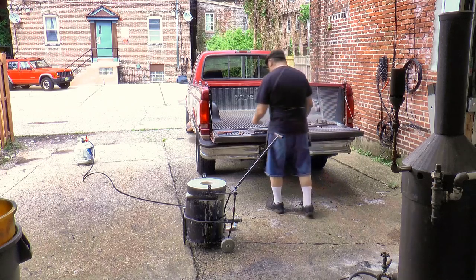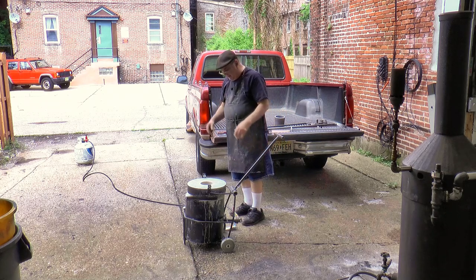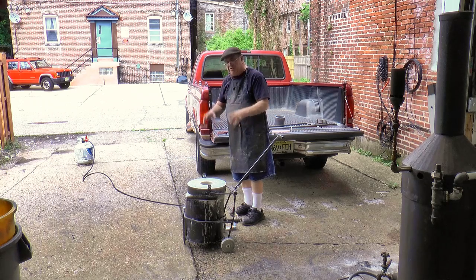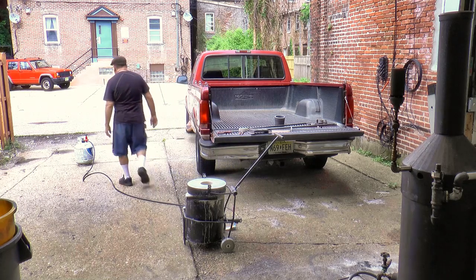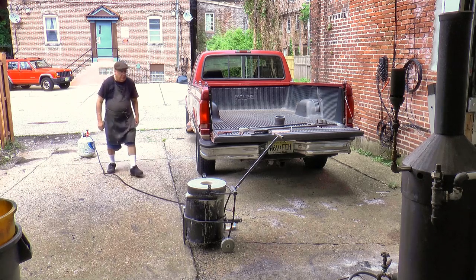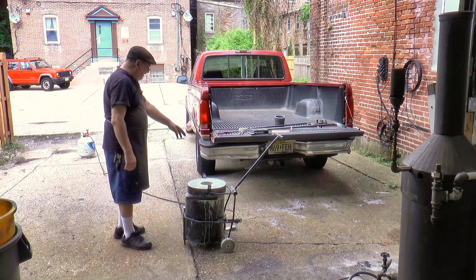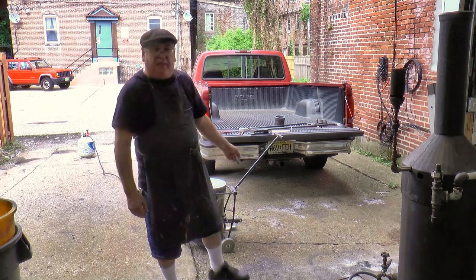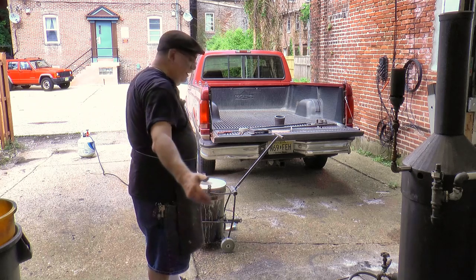I've got to make a few other tools, but for the most part that's cooking along now. You just let that go, and after a while when I'm running it you'll see water start to come out the bottom — as the water starts to come out, it's drying out. I've got a 15-foot hose here. This is called from the Cajun shop — I guess for turkey fryers or deep fryer stuff. It was $79 for the regulator, the 15-foot hose, and all the quick disconnects I needed. Down at Home Depot I bought a quarter-inch ball valve to shut it off and on. Works beautifully. Before we actually make castings, we're going to probably melt some metal and pour it in the ingot molds just to try it.